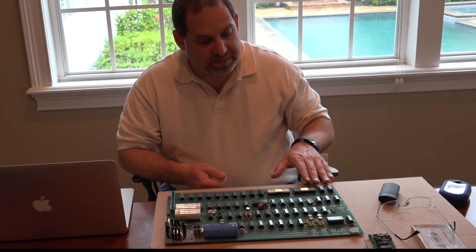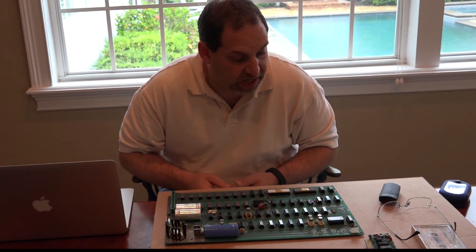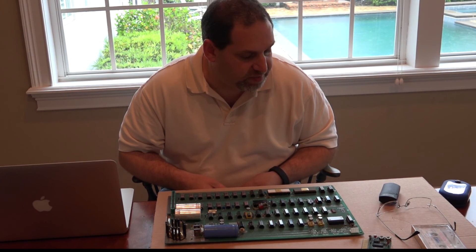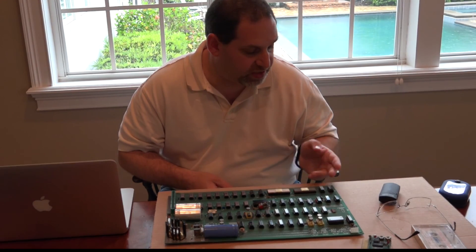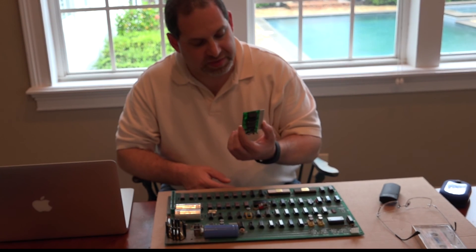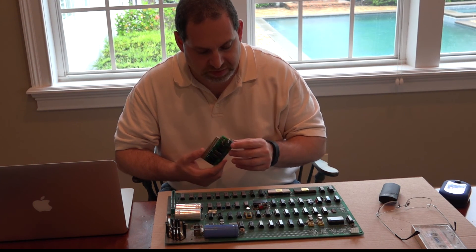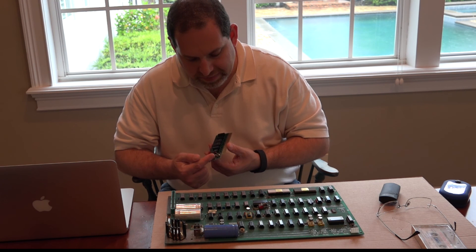Interesting things about this board — the chips are all TI chips. The PROM chips do not have the Apple symbol on them; they are dated early — MMI for 1976, week 10 — but they don't actually say Apple on them. Someone has Sharpied on A1, A2. The cassette adapter is very similar in that it was assembled the same way with the wrong versions of Apple II sockets, a different LED, different cap, different sockets — so it's almost like this was assembled later by hand.